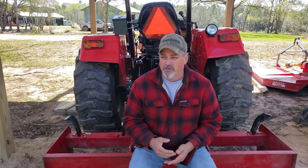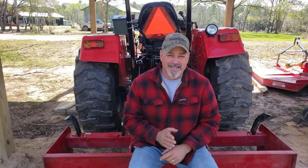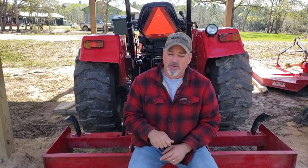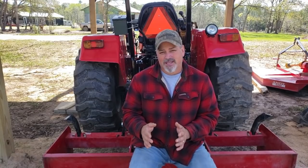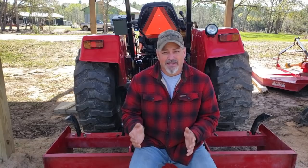You'll crush your toe, you'll maybe catch a hand in something, between the box blade and another object or something. So be real careful. It only takes a second to turn your tractor off, get off of it, make your adjustment, and get back on it. And that 30 to 45 second process may save a limb. So be careful when you're operating a box blade.